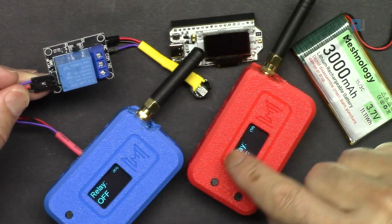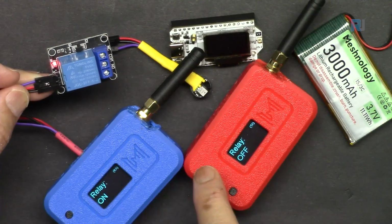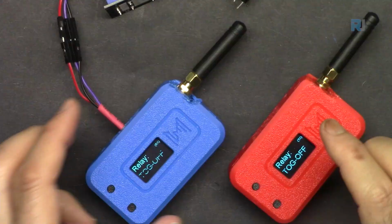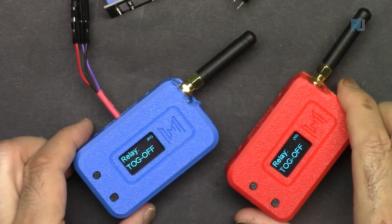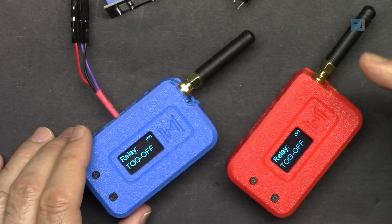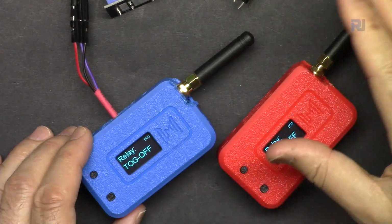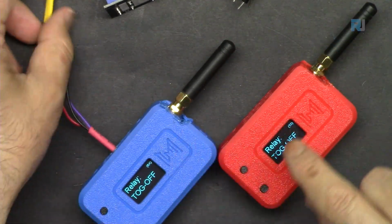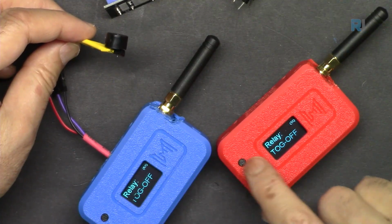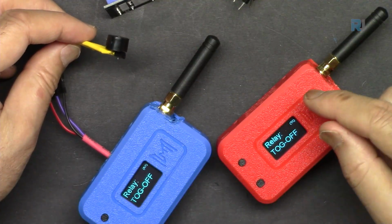So instead of buzzer, we could use a relay. The relay is turned on and off so you can control a load. This can be used very easily as a burglar alarm. So from long range, maybe 1 mile, 2 mile, 5 mile, even 13 mile. So the door or something opens, it can send you the signal and the buzzer will turn on like that. So instead of this push switch, you can connect it to a sensor. For door monitor, I have separate video.